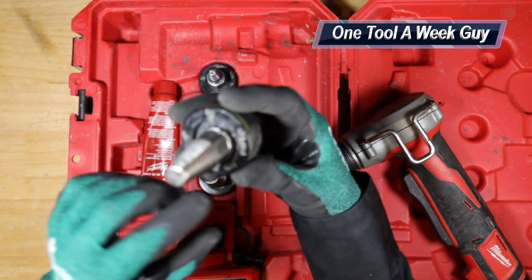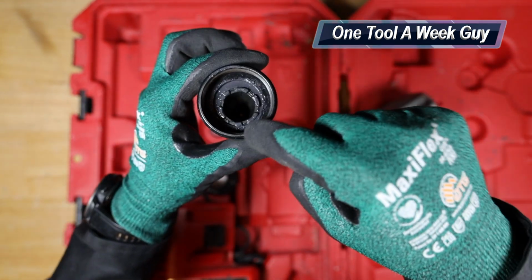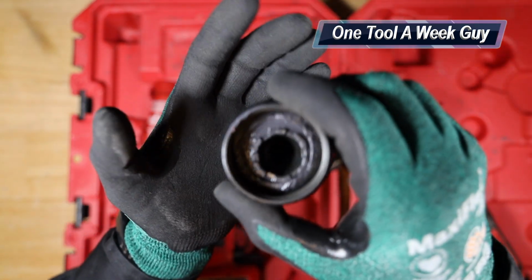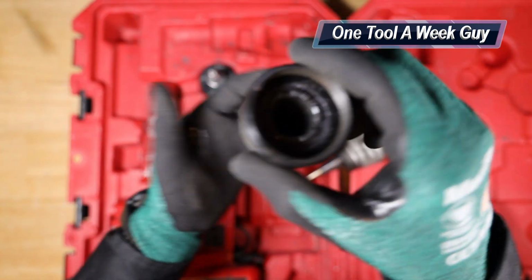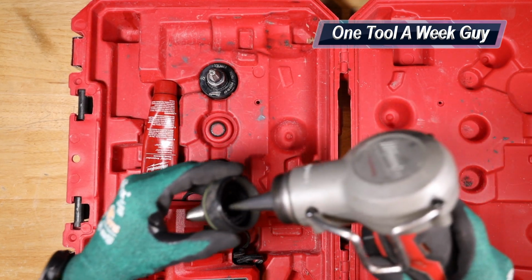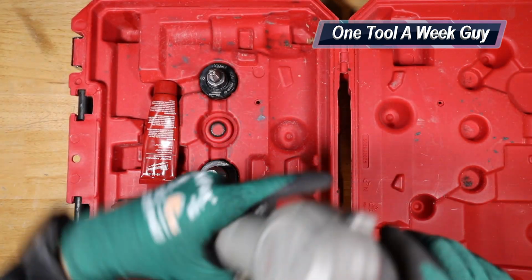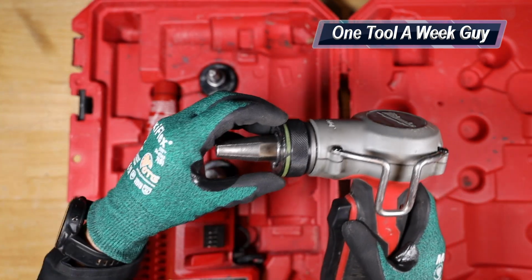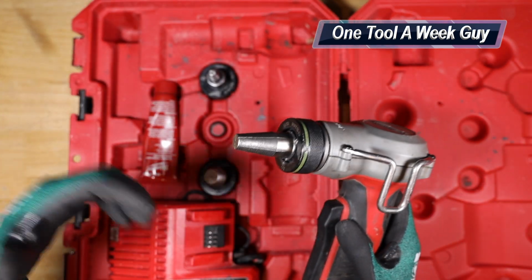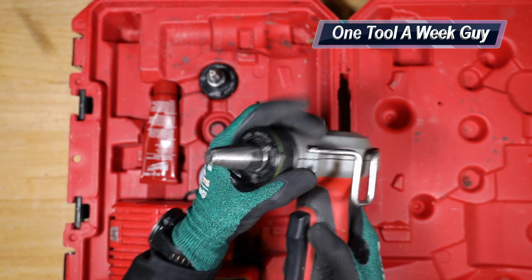Of course, also, guys, it is going to be the 3/4 heads, and if you could see in the back, the teeth, let me see if we could catch it. There are teeth right there that rotate it, and that's going to make the rotation. So if you go ahead and put the 3/4 head on there, and of course I didn't put any grease, but that way you could see it. The expanding tool is actually going to expand the PEX. Now, of course, Uponor uses a type A PEX, which is going to be able to expand.